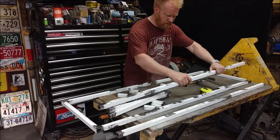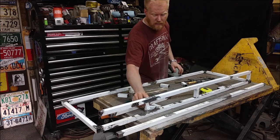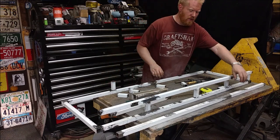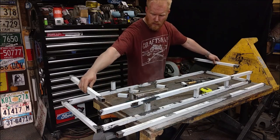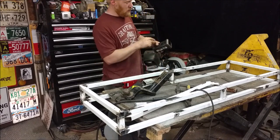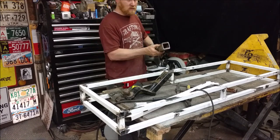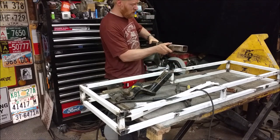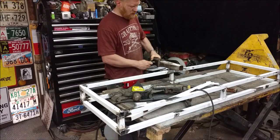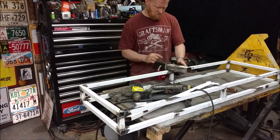This is all just scrap steel, and one of them actually had the pieces — I cut it out to leave a piece attached how I wanted it. Essentially I'm just going to have a bunch of these standoffs to give myself spacing all the way around, and then just a mimic of the exact same thing below, just on top to give me a little tray. So the receiver hitch part — this is a receiver hitch that actually goes to a vehicle. I drilled roughly a 5/8 inch hole and enlarged it just a little bit. So this is the shank that actually attaches to this, and this is what would be attached to the vehicle, just like a trailer hitch. That will slide in and you'll use your standard pin to hold it, so this just has to get welded to this piece.